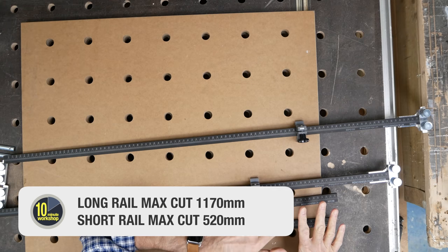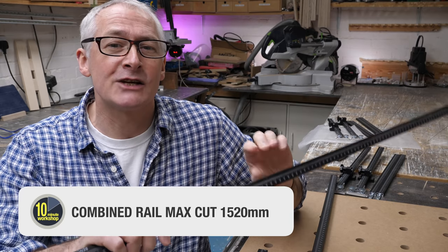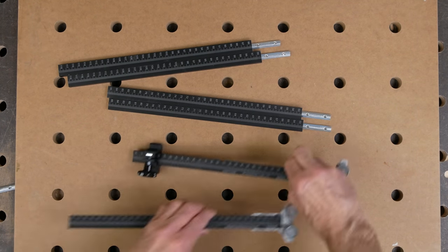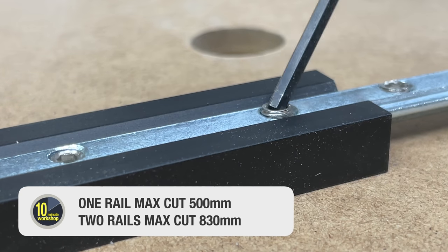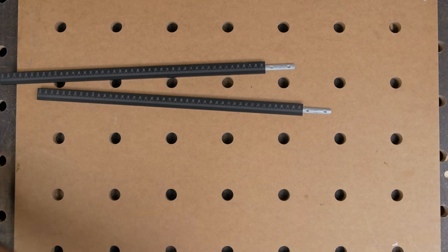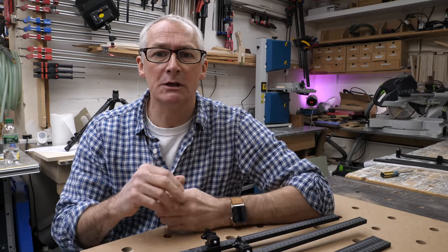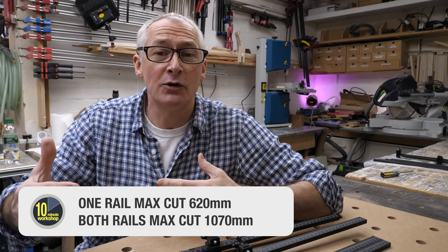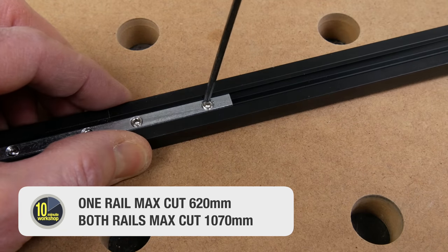I think that set is probably best suited for workshop use. The 350mm extrusion isn't quite long enough to let you rip a full sheet in half, for example, and using a full metre of rail just to get an extra 70mm of cut or so might make it a little bit unwieldy outside the workshop. In another set you can have that same rail cut into three 330mm (13-inch) sections with joining bars supplied, so you can make up the full rail but also have it shorter for narrow cuts — and having the rails this much shorter makes them easier to store in a systainer as well as easier to handle. And finally there's the simple two-rail option with a pair of rails at around 450mm, and that's the one I think I'd go for personally, because combined with the typical guide rail width of 200mm that gives you up to around a 620mm rip — a little bit more than half a standard 8x4 (2440 by 1220) sheet of MDF or plywood. And of course if you need a wider rip than that, you still have the additional rail that comes with the kit to add in and extend it.